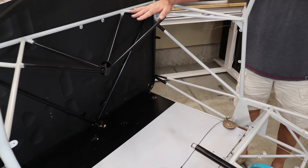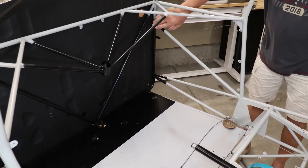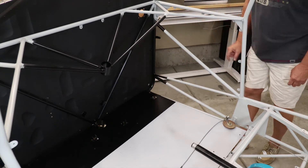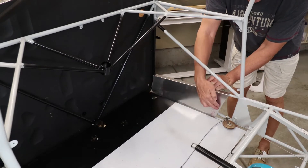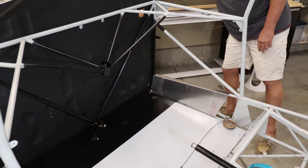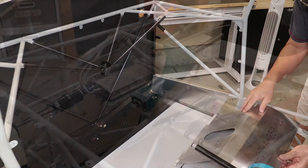I'll start at the front and work my way back. This is where the avionics shelf is going to be, so there'll be a big plate there with all the major components mounted to it. Then I'll run the major harness down the right side of the back of the firewall, and then down the lower right side of the fuselage frame. There's a panel that goes over this that will cover it, with fabric on top. Then I'll run the wires past that and underneath this other panel, so they all branch off from there.